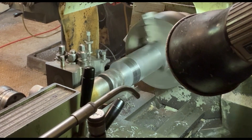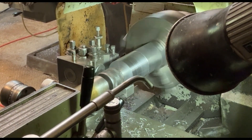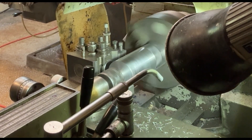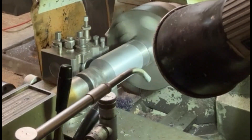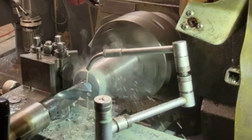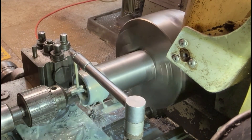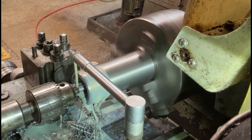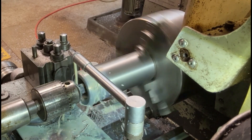Here we see the solid billet of steel I'm going to be machining. I'm turning down the outside diameter - I've speeded this up slightly so you don't get too bored. I've put a center in the end just to hold it a bit firmer, as I want to machine basically all the way down. Here you can see I'm putting in quite a large drill to bore it out, then a 14 millimeter drill to allow for the clamping screw that will hold this into the workpiece.